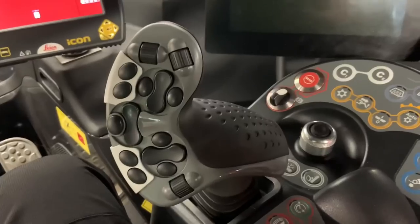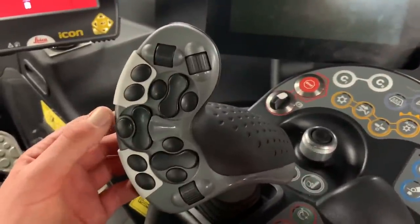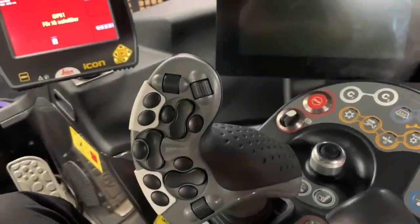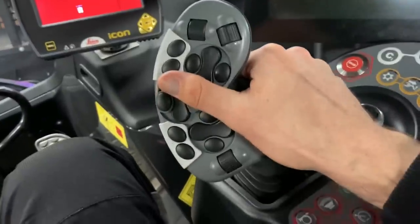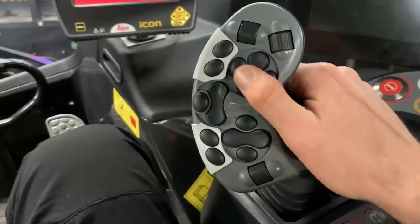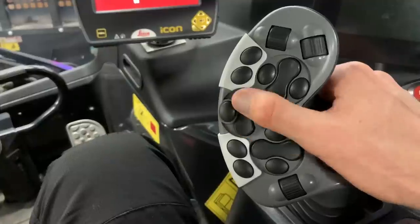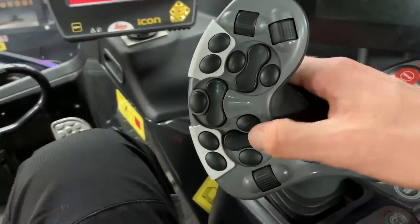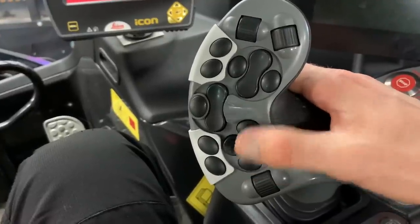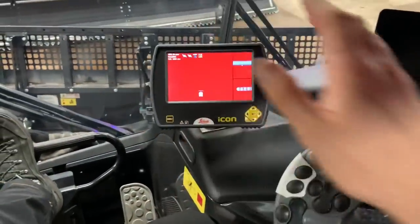Moving on to the joystick — it probably looks really complicated to someone who's never sat in one of these before. This is the best joystick I've ever used in a push machine. It looks complicated but it's really well laid out. Everything's easy to reach. You've got tiller lift and drop, your dumbo ears, tiller cut deeper or shallower, wiper blades front and rear. This is your tiller swing — you can swing the tiller manually left and right and lock it so it stays directly behind you. That's float, and if you hold it down that's your auto tracer, which adds a bit of resistance and counters where you're tracking so if you're climbing a slope it'll help your machine waddle up the slope.